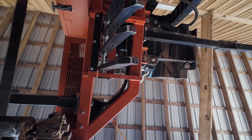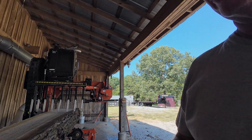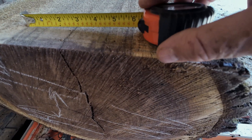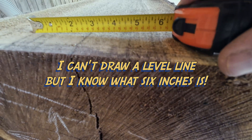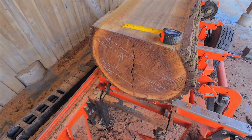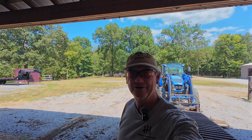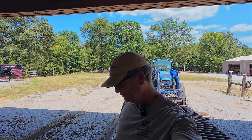I like to get six inches of heartwood on a board, single face. Let's see what we've got — it's exactly six inches. That was by eyeball. You'll also notice these wavy marks right here. There's a reason they're doing that even though my sawmill's dialed in — that's going to be a topic for another video because I know a lot of people have that happen. I'll cover that and tell you how to get rid of it.